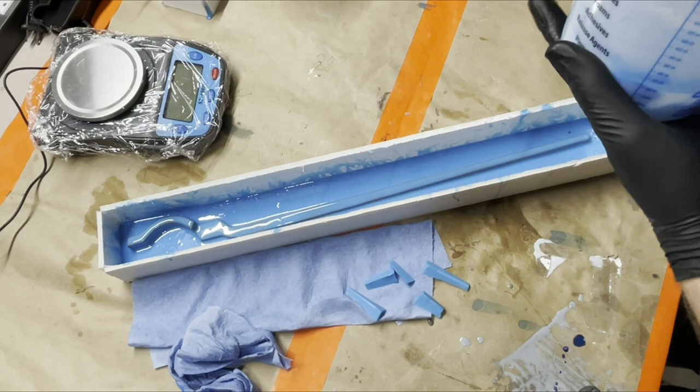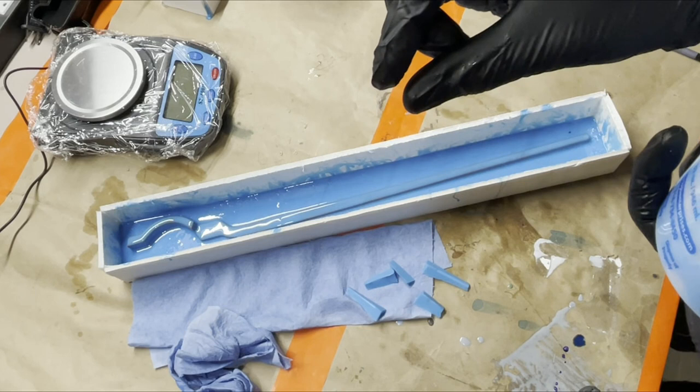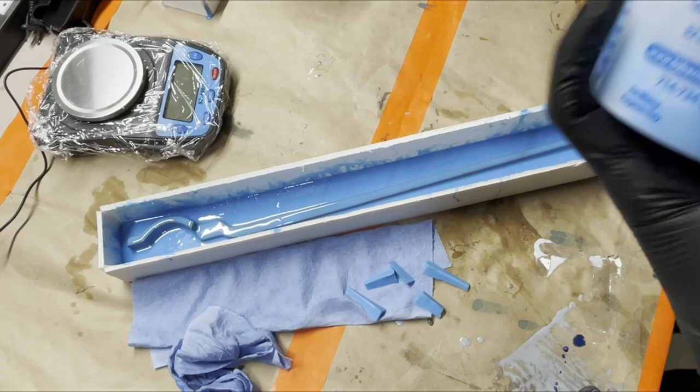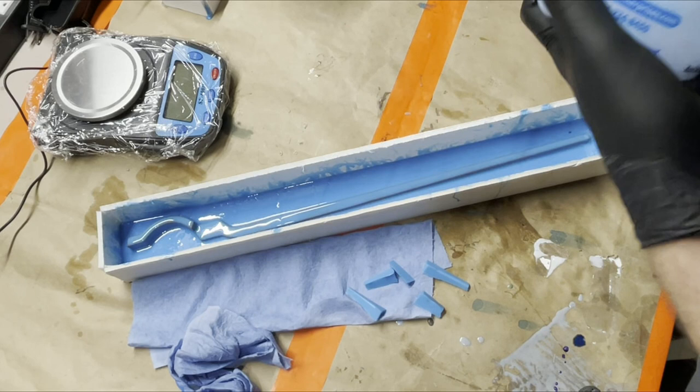Even with the brush on BR75D, that only takes, probably about a quarter inch shell, because this is a pretty small and lightweight piece. And even that will be less material than the silicone would be, and that stuff is cheaper than silicone. So not only are we saving a ton of materials, it's also saving a ton of money. And of course, the less materials you use, the lighter your stuff is, which makes it easier for the casting process.